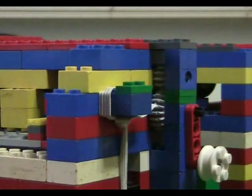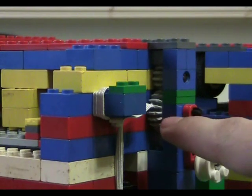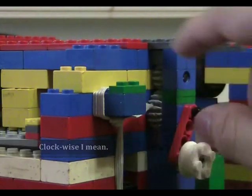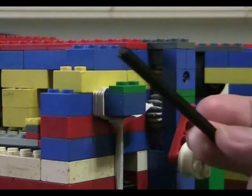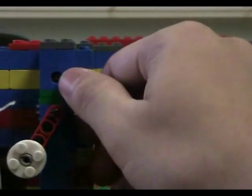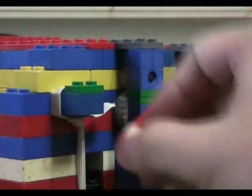And the wheels are actually turned by this set of cogs over here. Now, as you can see, it's a gear reduction. There's a big cog and a small cog, and I'm turning the big cog counterclockwise, and it turns the small cog counterclockwise. And the small cog is actually driving the wheels through what I call a cross truss. I'm not sure. I have a piece right here. It's a cross in the cross section. You can see it here also. And this basically allows the wheels to be driven forward, I guess, in that direction, while I'm turning in this more comfortable direction.